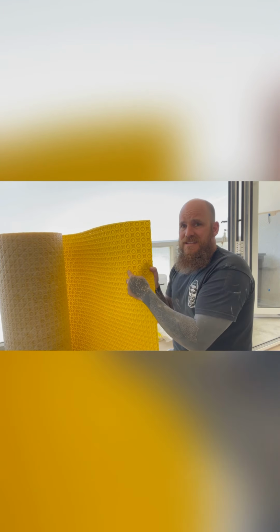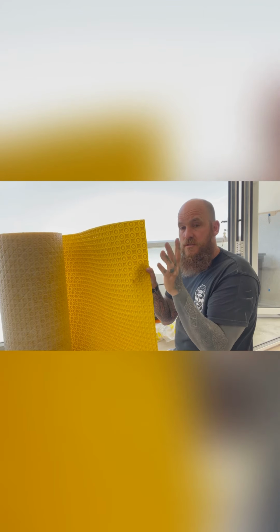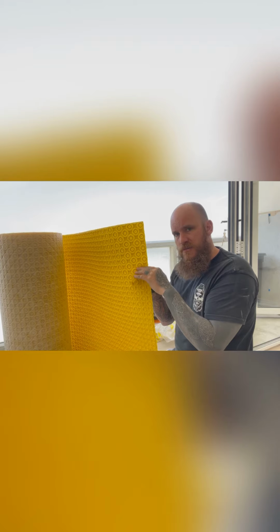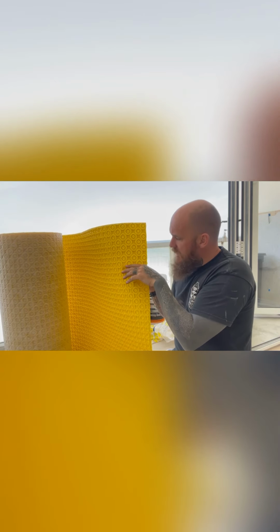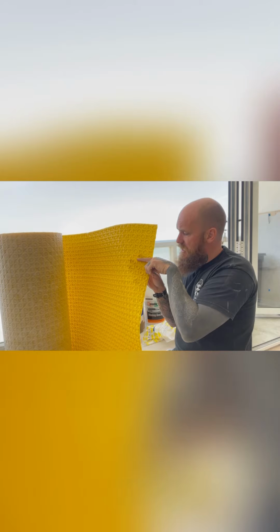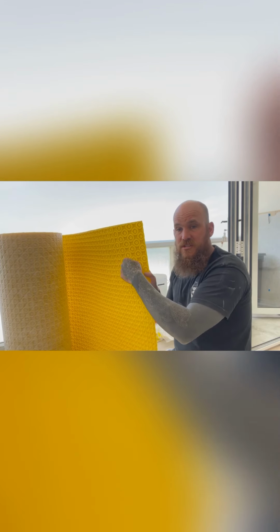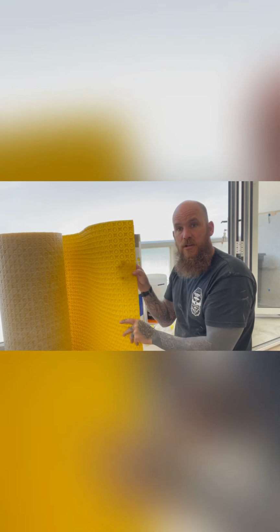Another thing, you can only use a certain wire in this system, up to, I think it's 5.5mm thick. And then you're protected, so when you're troweling, you're not going to ding that wire because it's in between the matting. And it saves you self-leveling, then just as you lay the tiles, backfill the mat in, and then done. All right.